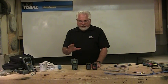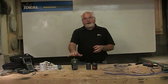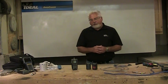Now the VDV is the upsell of this thing, and it's going to be a little bit more money, usually somewhere around $100, a little over. And these are usually somewhere under $100 in LinkMasters. And it's great if I'm a tech that also needs basic coax and basic phone testing as well. And as a technician, most of us need to do all 3 of those. So I kind of think that's the meter you might want to purchase. So there you go. That's the differences in the 2 meters.